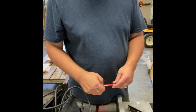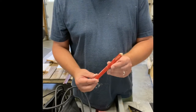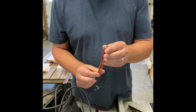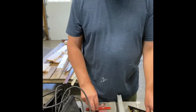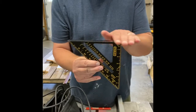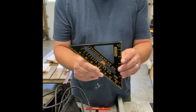I want to show you a few tools we'll be using today — pretty simple and common tools. We're going to use a simple carpenter's pencil. Carpenter's pencils are a little larger than normal pencils; they're flat with thicker lead so they're not as easy to break when putting marks on wood or rough surfaces. We're also going to use a little speed square, which simply gives you a 90-degree angle so you can cut stuff square and not have things cut uneven.